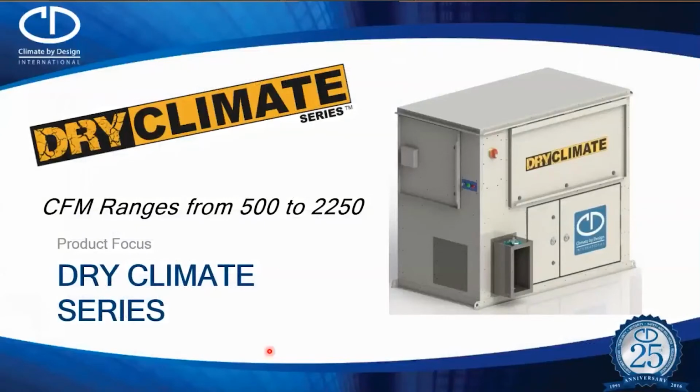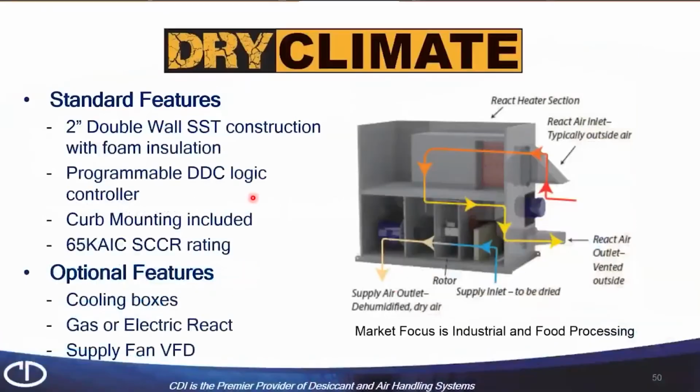So the dry climate, this is what the product looks like. It's a small packaged unit. CFM ranges from 500 to 2250 again. This is the airflow path of that one. The blue line here is the process inlet or supply inlet and then supply outlet. The new reactivation makes a U-shaped turn. It turns back on itself and discharges on the same end as the reactivation inlet. That's a configuration that's unique to that product.